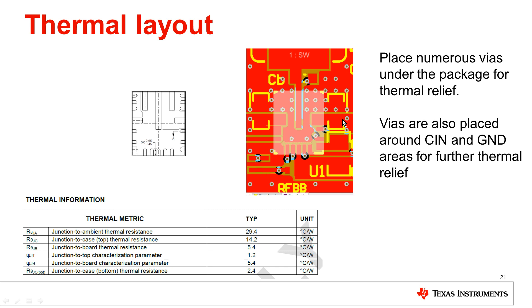One other recommendation is to put vias into the ground plane on mid-layer two as well. However, you shouldn't rely only on vias. Some ICs with pins all around and a thermal pad in the middle must route heat through vias, but for the Hot Rod package and this device in particular, we've designed it so that heat should spread across the planes — on the ground and on the VIN. That's the basic guidance to keep in mind when doing layout for the LM53635 or any other Hot Rod package.